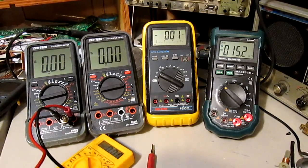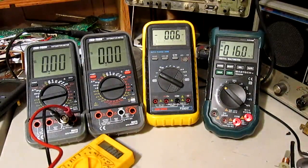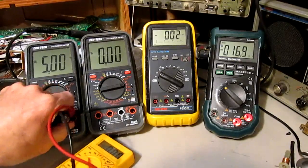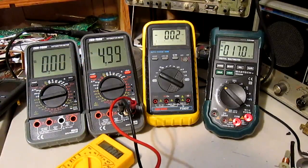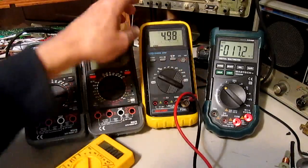Anyway, I can do this quick — looks like the battery in the camera is just telling me to hurry up. Let's measure with the first Centec. We'll put this on the camera. So we've got 5 volts on the first meter there — see that? Now plugging it into the second meter, we got 4.99. It toggled to 5 — so it's exactly the same as the other one.